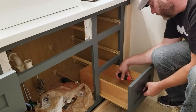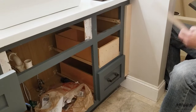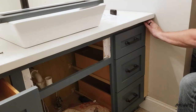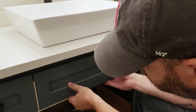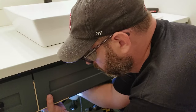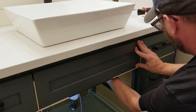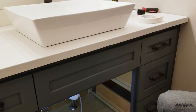This makes installing drawer fronts super fast, especially when using guides to hold everything in place. To install the next drawer up, I add a 1-1/8 inch spacer on top of the previous drawer and then add the next front, repeating that process all the way up the cabinet on both sides. For the false front in the middle, I add a pair of 3-1/4 inch plywood cleats to screw it into place. My wife also helped by painting the face frame of the cabinet while I was busy working on the fronts and the top — teamwork makes the dream work.